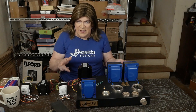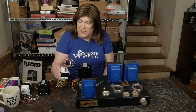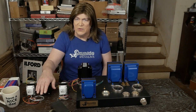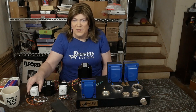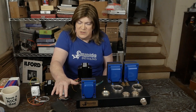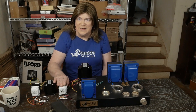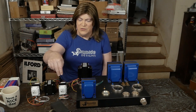A new one I want to try: I bought a pair of really small push-pull output transformers from Thermactic Labs. These are the transformers I'm going to use on my 6P1 push-pull conversion along with a Hammond power transformer to make a super 6P1. That's a later project, but I got these ordered at what I thought was a reasonable price. They're nice and compact, fit right on top of that little 6P1 chassis, rated at 10 watts, 10k with ultra-linear taps. Those should work ideally.